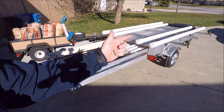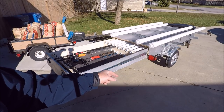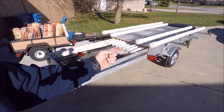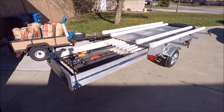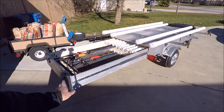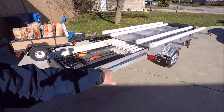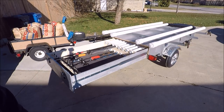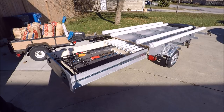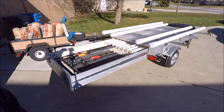You won't be able to reach all the way inside to screw the drawer slides into the side panels with only 10 inches of room. I found it was easy to just lay out my center line on the side panels, lay the drawer slides down, and screw them in place. That way when I assembled the box, they're already installed.